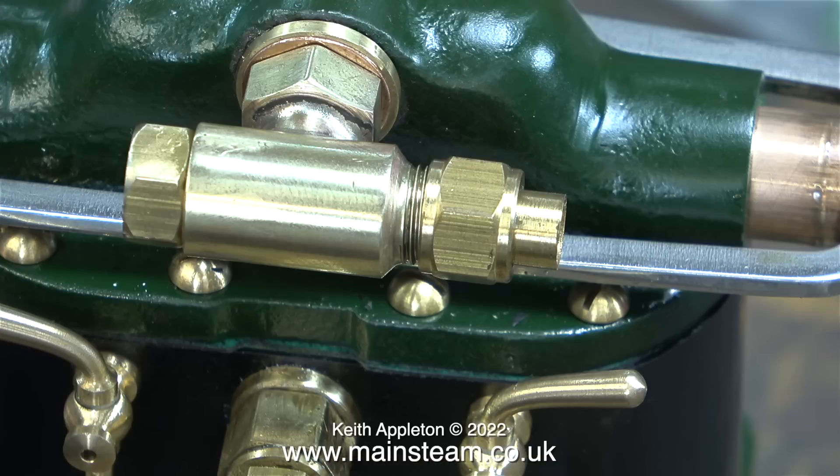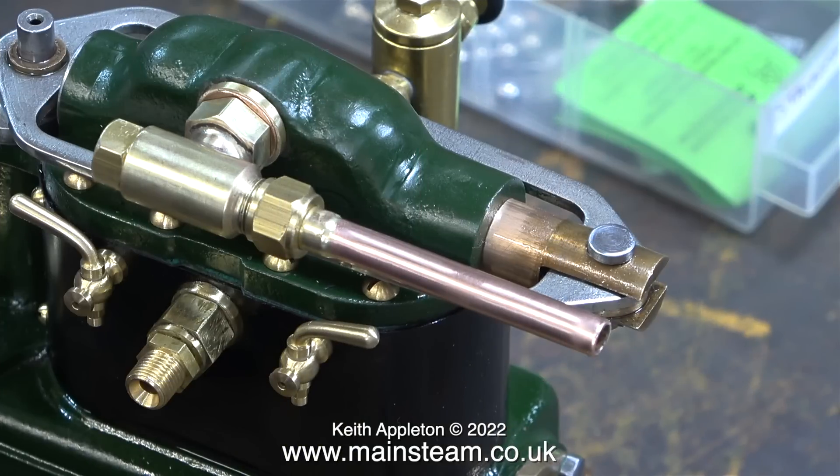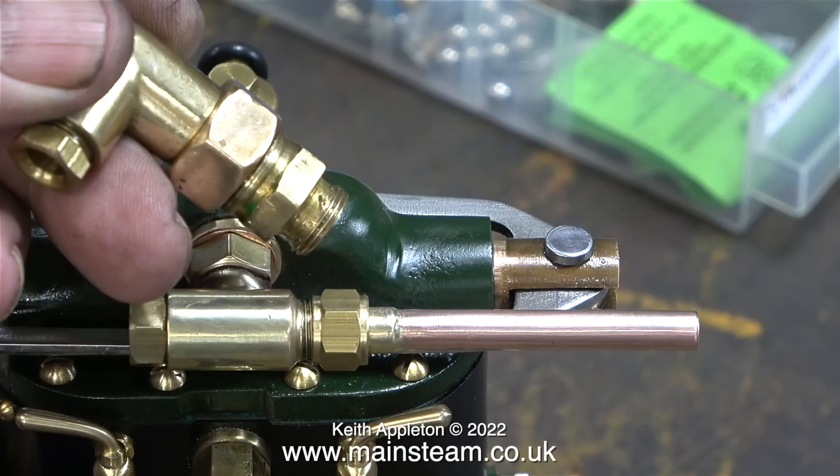What I need now is an exhaust pipe. I silver-soldered a piece of quarter-inch copper pipe to a coned union and then fitted it as shown. Now I think the overall appearance is far more pleasing than it was with the original massively over-scaled fitting. The arrangement of this steam chest and the one on the red series that I have is quite different. I think it's time to connect the airline and have a listen to the engine.